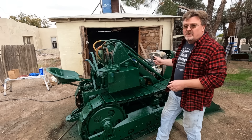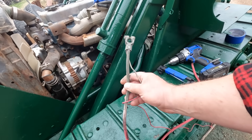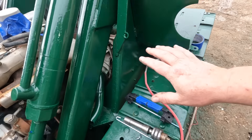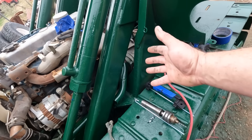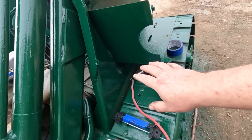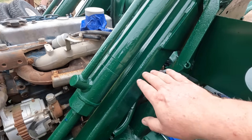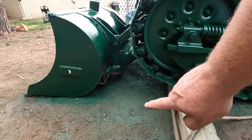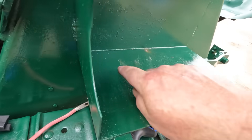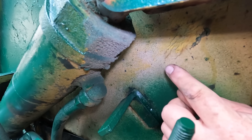Which means I need to get it running again. I already uncovered the engine and now I'm working on the battery and electrical system. I found an old positive cable in my bin — it's even got an output for extra power for the dashboard. The old cable ran on the outside and the sun baked the insulation until it was falling apart, so I want to run this cable under stuff to minimize sun exposure. I also have to make sure when these arms move up and down I don't hit the battery cable. I think if I drill a hole right here on the corner it'll come around underneath those hydraulic cylinders and still be clear.